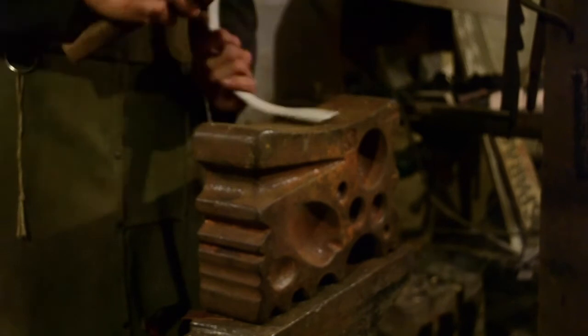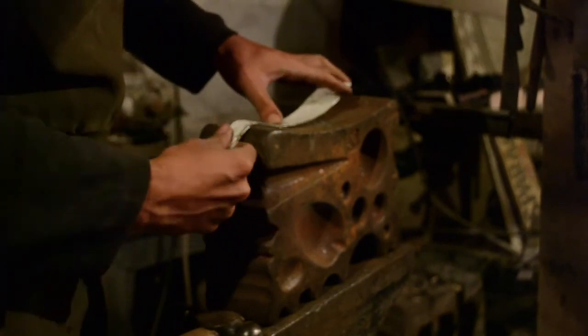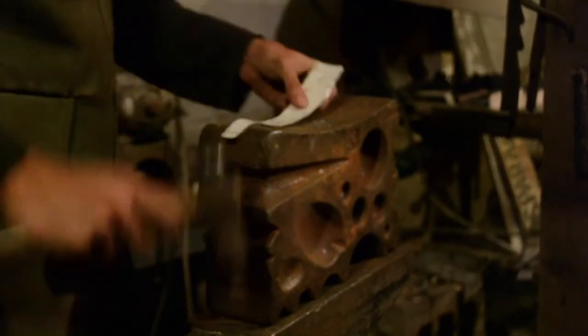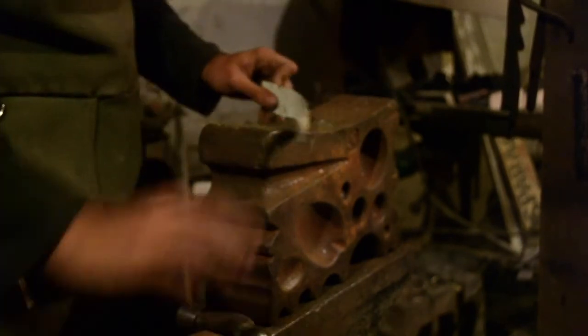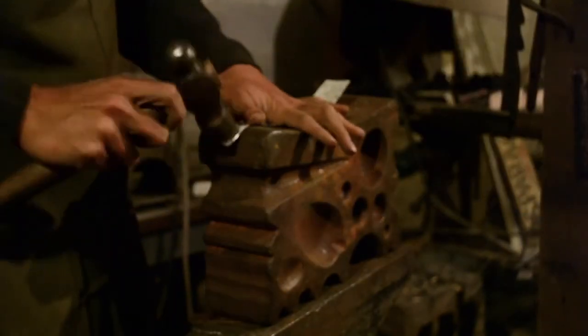I want each of the pieces to roughly curve to the shape of my head, the exception being the tip and the base of the piece. The base of the piece needs to be straight for about 3 inches or so. If the base shares the same level of curvature as the rest of the piece, the brim of the helmet when it's finished will cut into the sides of your head as you wear it, which is not so good.